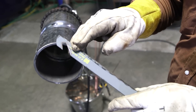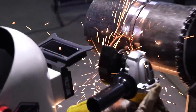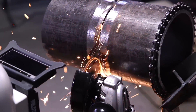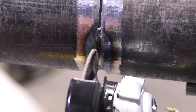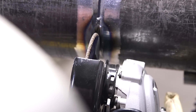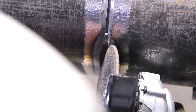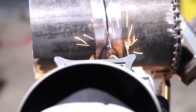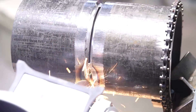It's got a nice little hook on it. That's going to help us deburr the inside and clean it up. We'll grind it up, prep it back up and try to get a good tie-in. I want to point out the way I'm grinding - at first I was grinding down deep straight, and then as I started to get down inside, I started turning my disc a little bit. This will kind of create your bevel back again, turning it both ways.